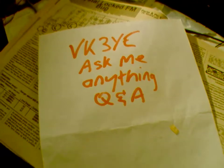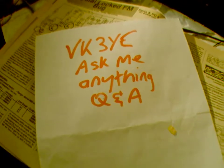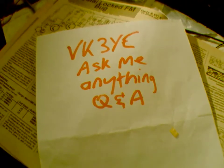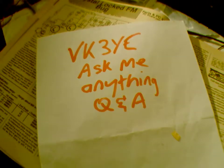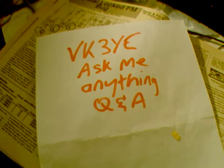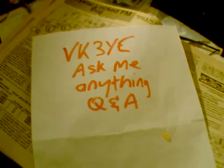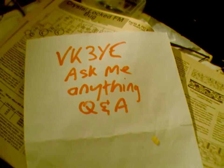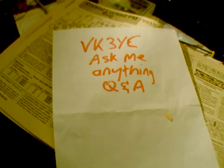Oh, that's right, it's in the other room. But something else, talking about using materials, I was given a very thin bit of mica. So I might do an experiment on making a capacitor with printed circuit board. And I could experiment with mica and compare it with food wrapping material or paper and look at dielectric constants. So yeah, that's a possible experiment.